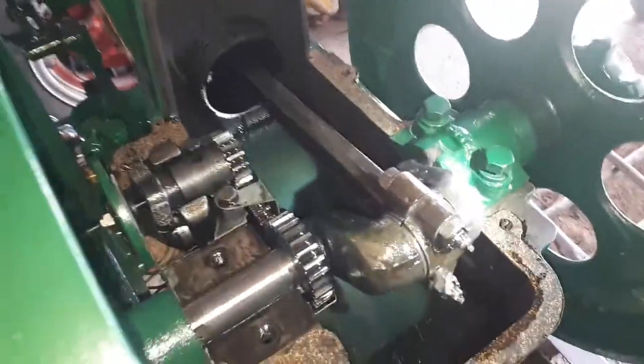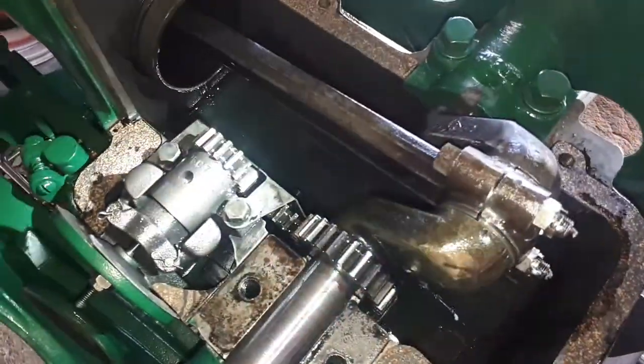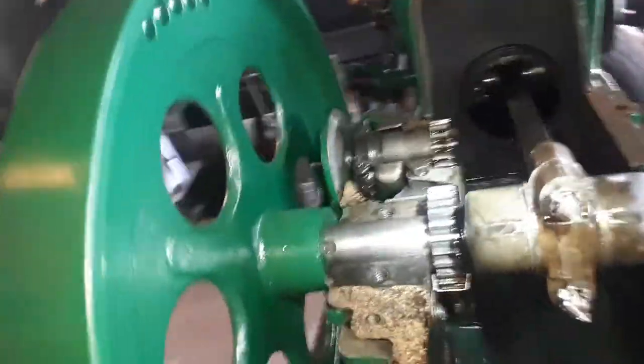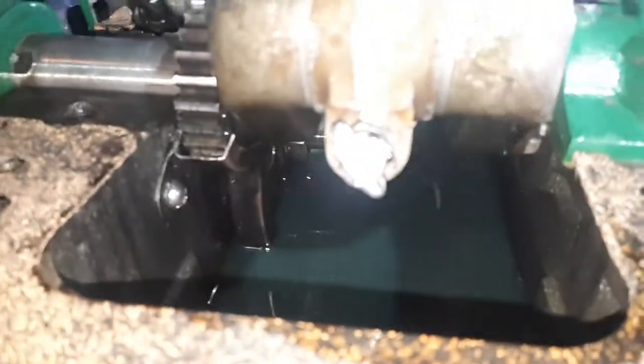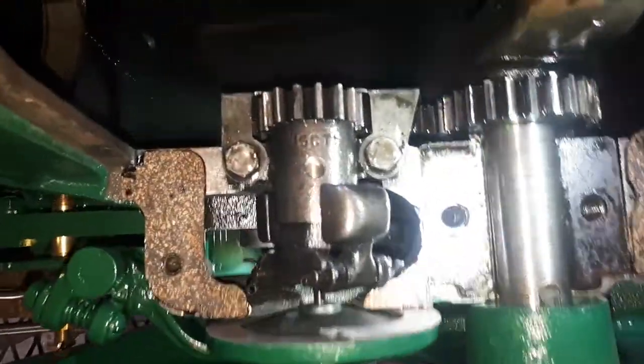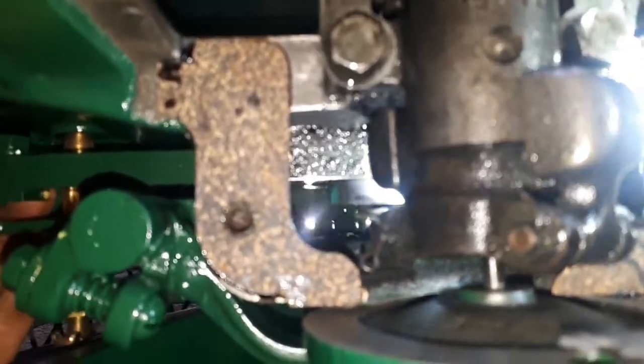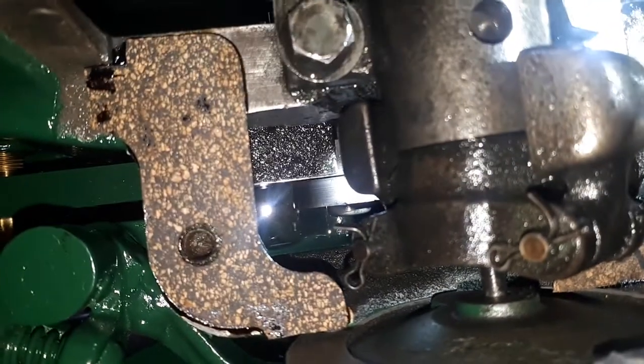I guess you guys can see the internal workings now. Pretty simple Stovers. You've got your governor, and that's just all oil bath. Nothing super special. Look down in there, you can see your latch out rod, latch out on your cam. Latch out's there. It's just a little round. You can kind of see that roller right there in the center of the screen.